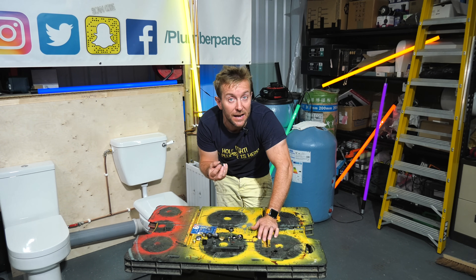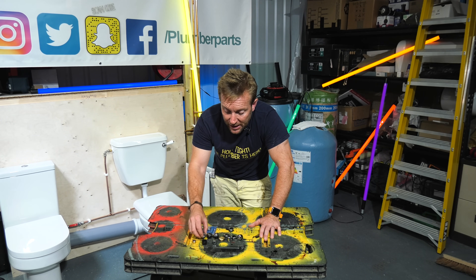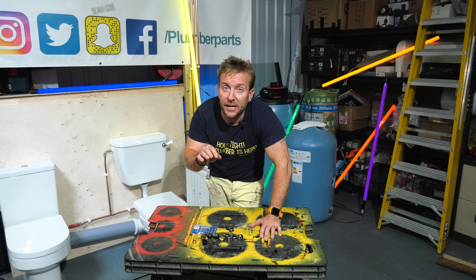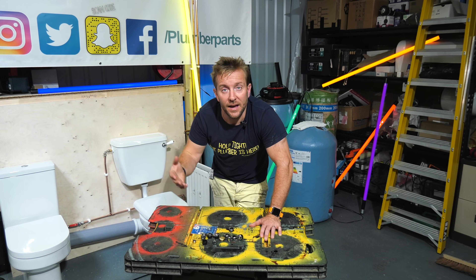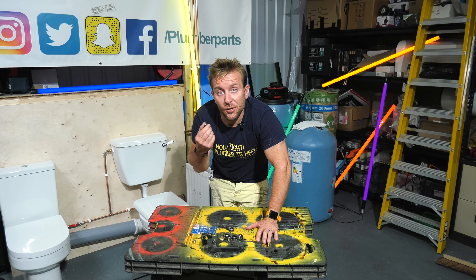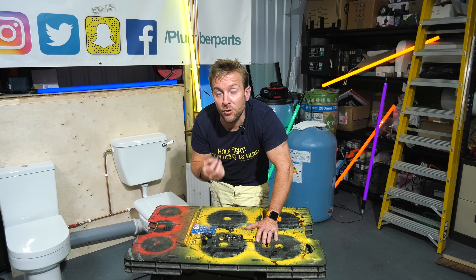You can use them like that, but you're probably going to need to leave them a couple of hours — and the hotter the system is and the higher the pressure, the better. These products, although very good for helping you vent out a whole new system — especially if you've got a hundred radiators — you could put one on each rad and that gets rid of the labour cost of going round and venting each one. They'll also make sure radiators are always getting rid of any air. On a new system with lots of water put in, there's a lot of air in that water that separates over a couple of days — these will allow that air to come out. For the lifetime of the heating system, they'll always allow any air out through oxidisation or if the pump speed is set too high, meaning less rust and fully hot radiators that emit the most heat and are most efficient.